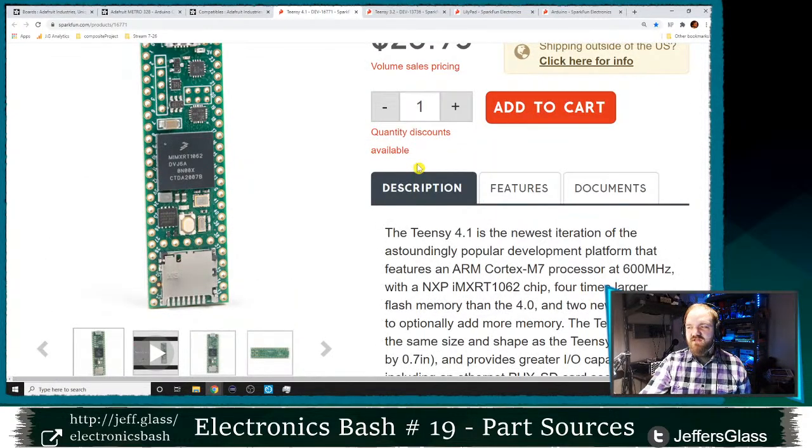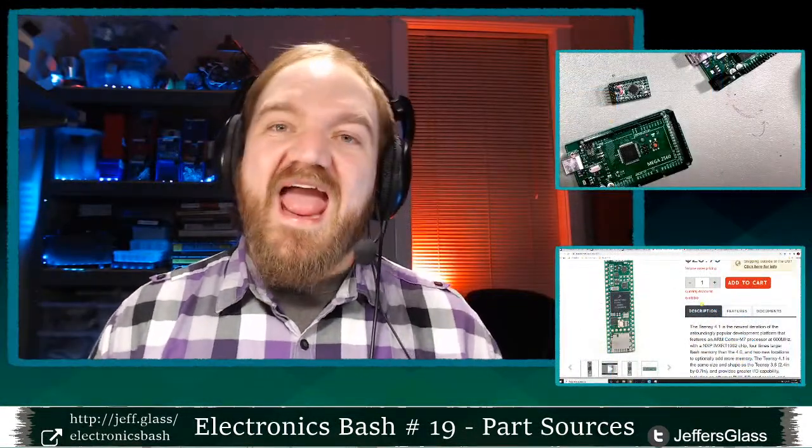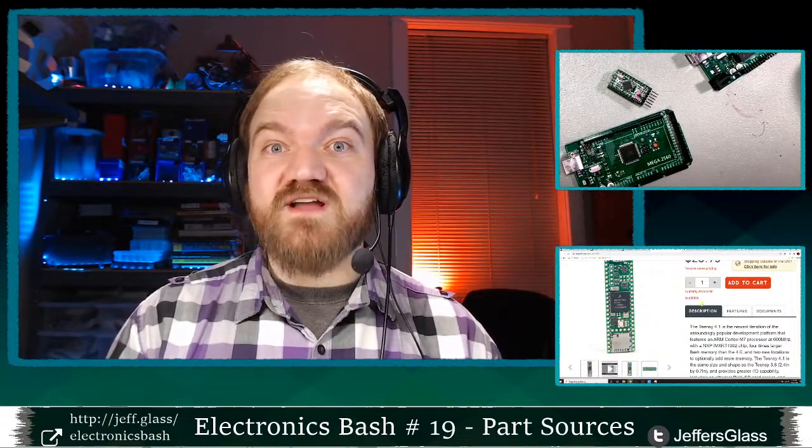Not all of the Arduino libraries may be ported to them, so they might not be as approachable as something that's actually an Arduino-branded product. But if you're looking to do an application that needs a lot of processing speed or interacts with a lot of different peripherals or deals with some of those more specific interactions like I2S, like doing digital sound output, the Teensys are a super powerful and really inexpensive option. So check out the Teensy line if that's something that you're interested in. PJRC, thank you, Chris. That's the company I couldn't think of.